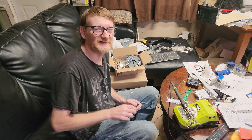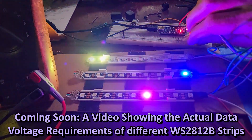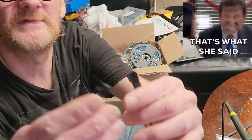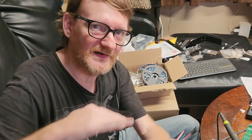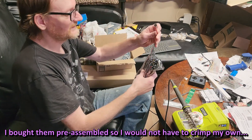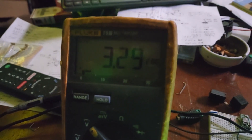That'll be in my Hyperion update video coming very very soon. But this has multiple uses — let's say you're working on an ESP project and you're just counting on the fact that sometimes you can get away with running 3.3 volts on a 5 volt LED strip. Sometimes you can, but it's not that reliable and it's very subject to interference. So I ordered a bunch of these male and female connectors — these will go in line with your current project, so you'll have two of these, one little circuit board, heat shrink, and you can just stick it in line and eliminate those interference issues.